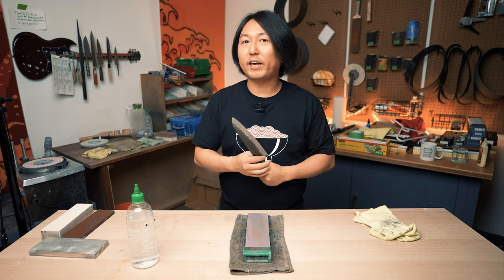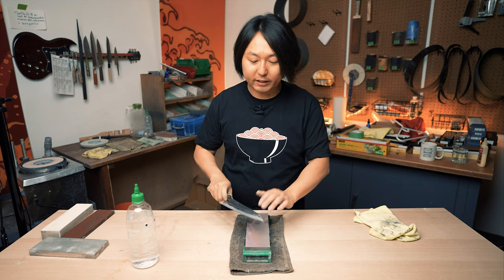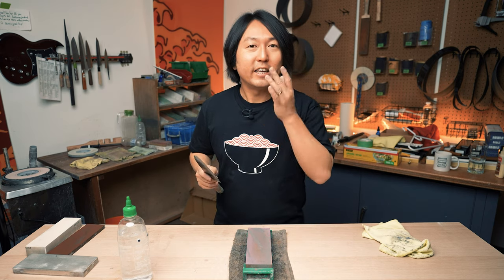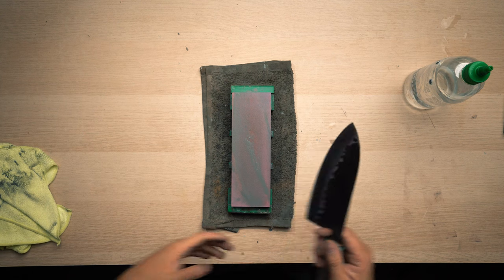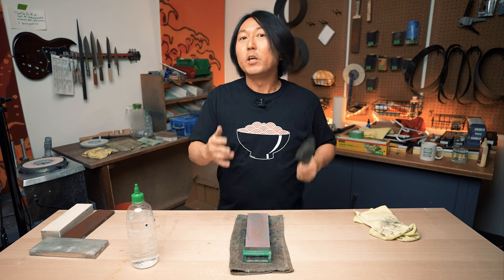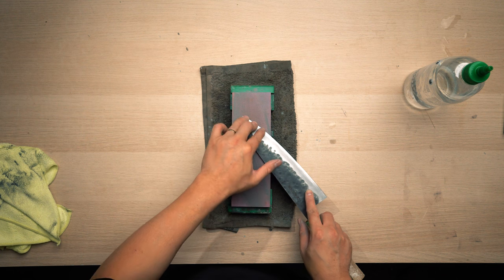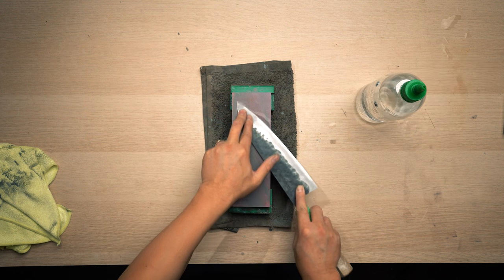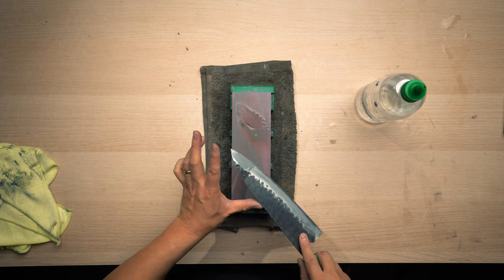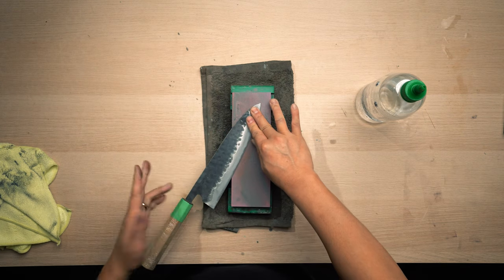When you're doing the second side, you can definitely do it keeping your knife in your right hand like this. Aesthetically speaking, only aesthetically speaking, it's better to switch the hand. So I do change my hand when I'm working on the second side, but it's the same principle. Basically, you want to sharpen along the edge first, then lower it down a little bit on the second, and on the third, make sure you are just sharpening the bevel side. You could do it like this, or like this.